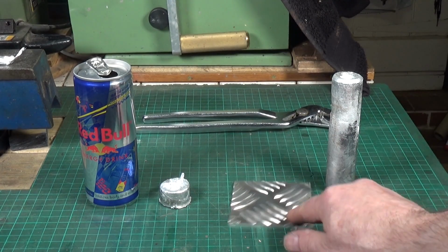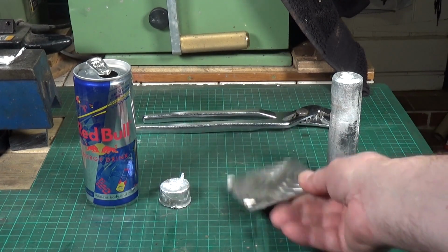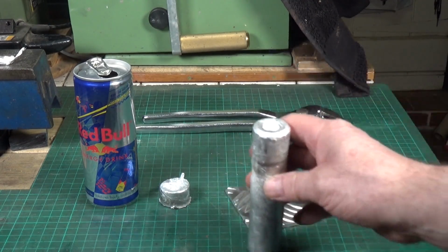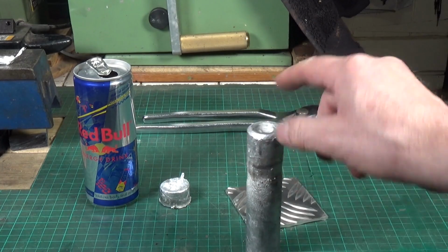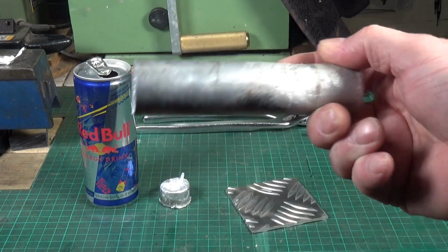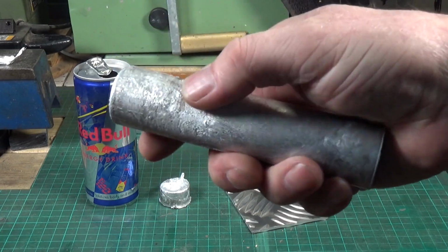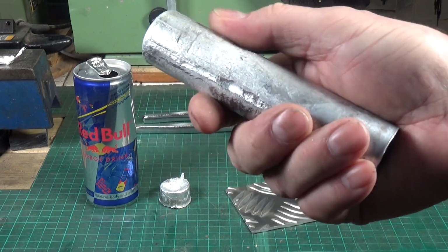The checker plate aluminium, on the other hand, turned out very, very well. I'm not quite sure what happened. It was poured that way, so that's the bottom and that's the top. Now, the first part came out really well. That's lovely, that bottom part. But then towards the top, there's a bit of shrinkage there on the side, and it's got all rough.